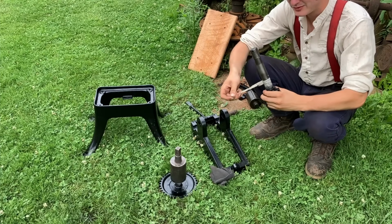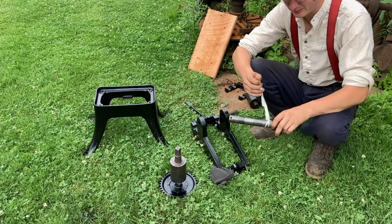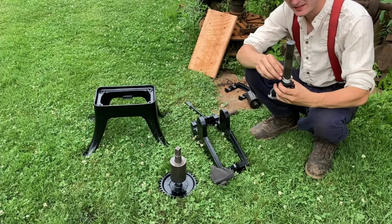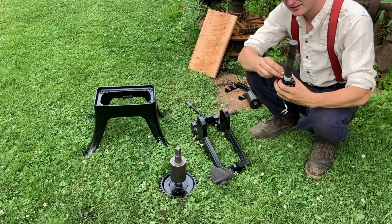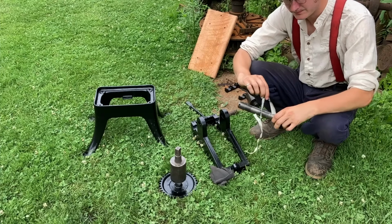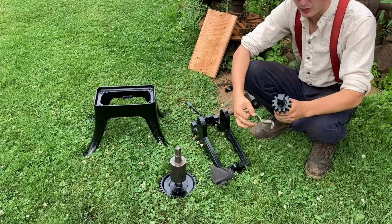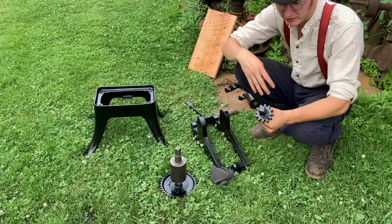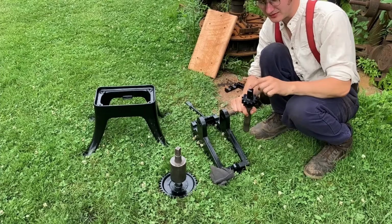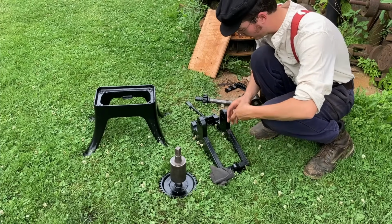And I know some of you are probably cringing out there saying, oh, don't ever paint the gears, don't ever paint the belt pulleys and all that type of thing. And I agree, generally speaking, but it was just going to be too much masking to not paint the gear teeth in this case. Ultimately it'll wear a little bit, and the tolerances are so broad in this case that a little bit of paint in the gears is no big deal at all. The only thing I don't like is the inconsistency, because this square shaft is painted and that one's not, but not the end of the world.